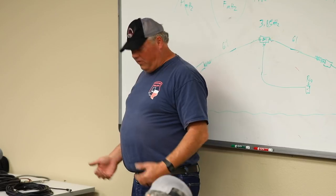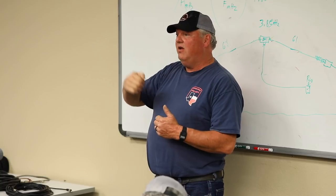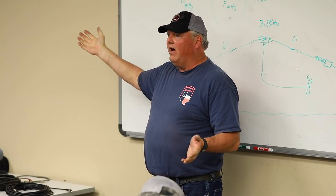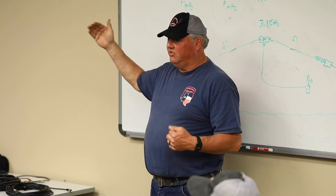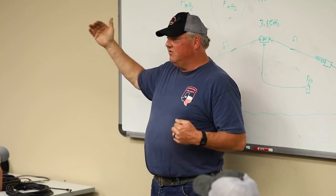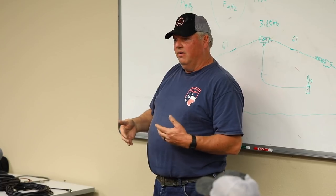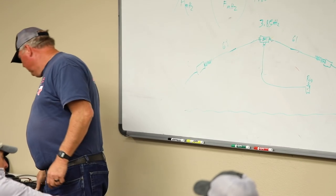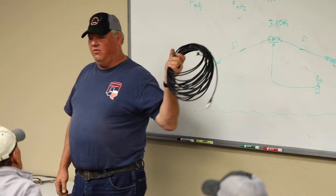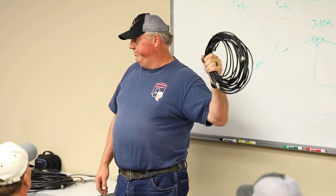Now, from the output of your tuner to your feed point, on even half-wave multiples, that coax does very little effect. The loss is still there, but impedance-wise, it's reflecting what your antenna is doing. So now I can measure it, I can tune it, I can clean this up and it works a little better. So you get somebody who just innocently orders this offline, 50 foot, hooks it to their antenna. All they want is a 40 meter antenna, and they have trouble getting it to match. This is the reason.